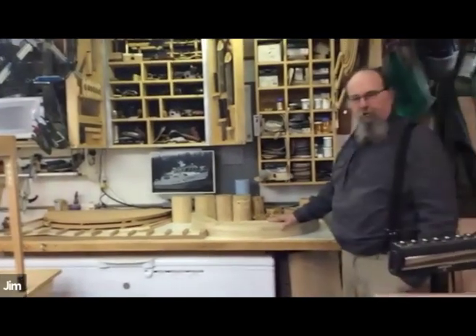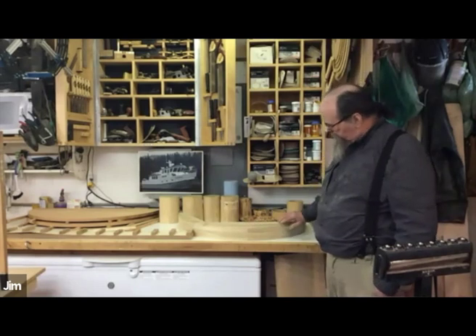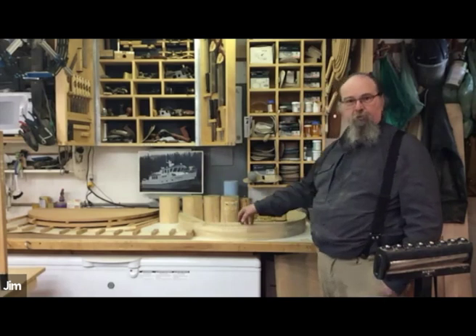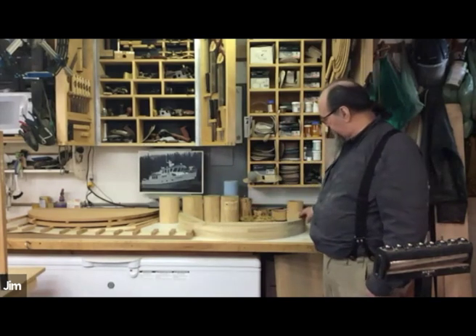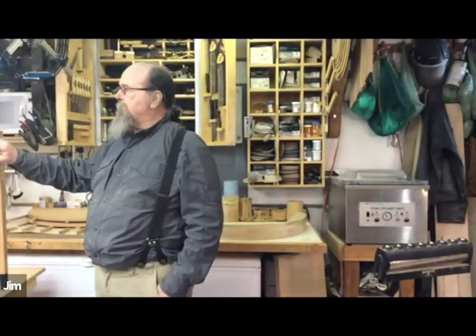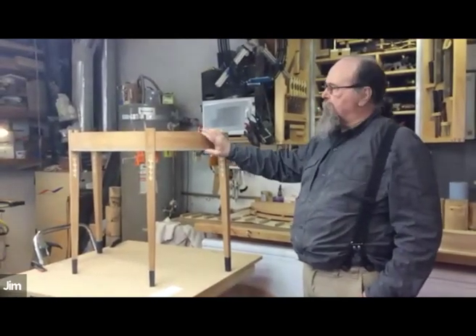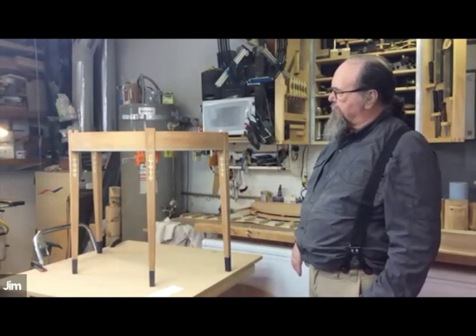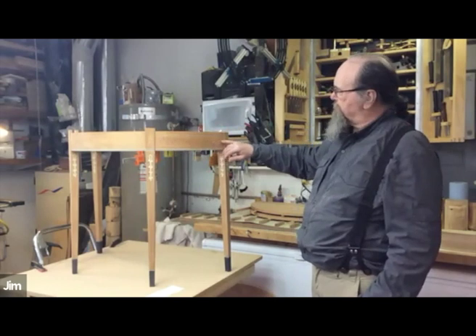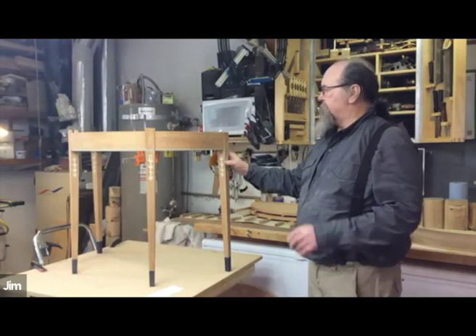This is how the whole process starts. You laminate one-by-fours of poplar and you do what's called bricklaying — you stagger the joints. Then you cut an inch and a quarter off of it, and to that you laminate mahogany veneer onto it. This is called the apron, and as you can see, it is a half curve. It's called a federal demi-lune card table.